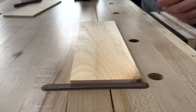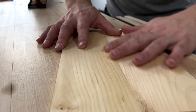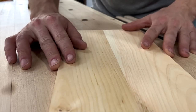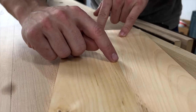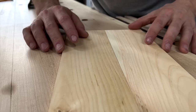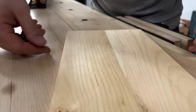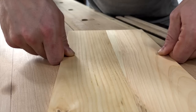Fantastic. Now with both my pieces planed and surfaced, I have to pay attention to my joint. There is a hairline gap between these two pieces in the center, which for a normal joint is exactly what I want — by the time I put clamping pressure on, that joint closes up nice and tight.